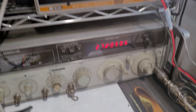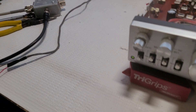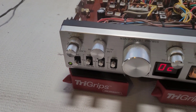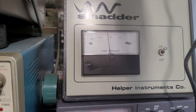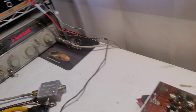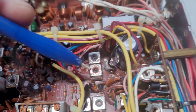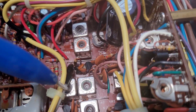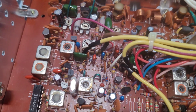I'm going to use a SINAD meter, and the point of this is to get better than 12 — basically we want to get better than 12, heading towards the 20 side on the SINAD meter. What we're going to do is start adjusting our receive: we're going to do IFT 10, 9, 8, 7, 6, 5, 4, 3, and go right down the line and try to get the most we can.